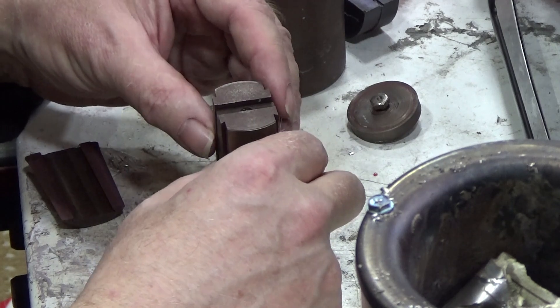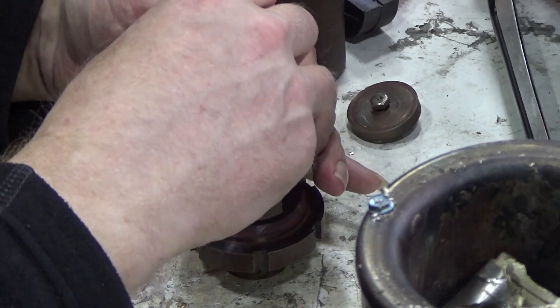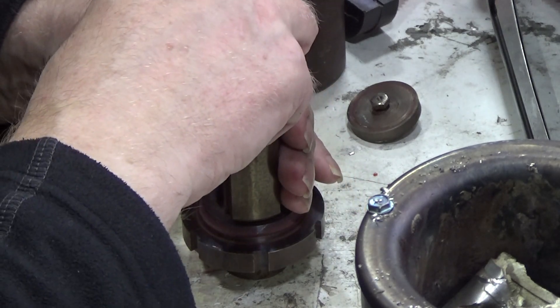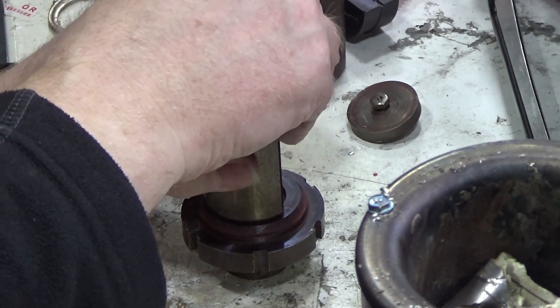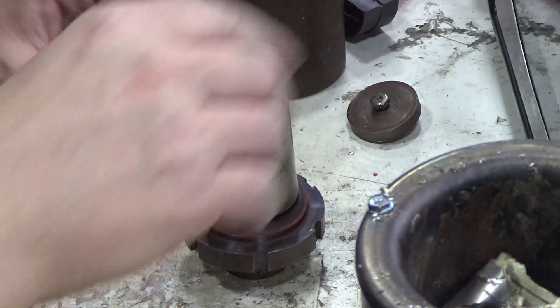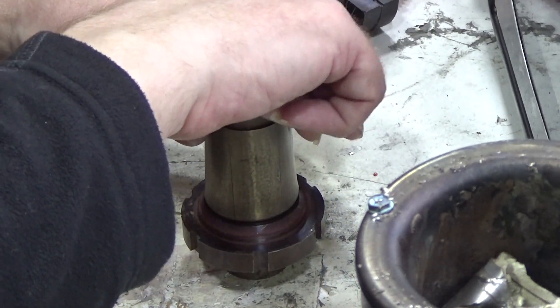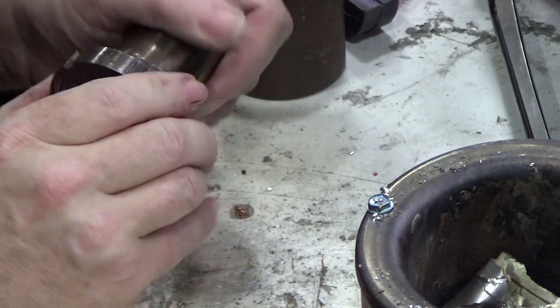After a fair bit more machining it's time to start casting. The first job is to assemble the mould. I can screw the screw up at the bottom to make space so it all fits together, then the four parts go onto the wedge like this, then the whole thing is clamped down onto the bottom nut with the screw cap.